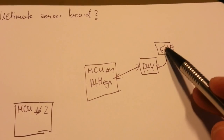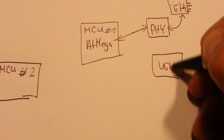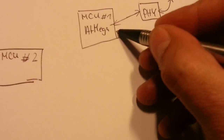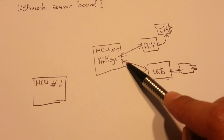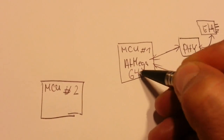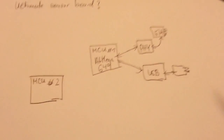I want to have an Ethernet interface — that will be the definite interface. There's also a problem with the power connection, and I might do a USB interface as well. This must all be connected to an ordinary ATmega — the 644, for example. That's a smaller-cased controller with 64 kilobytes. This time I don't want to have a problem running out of program space or memory.